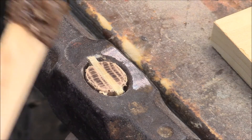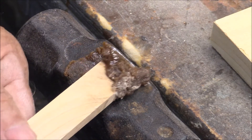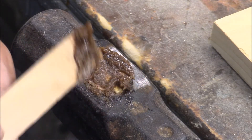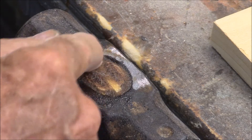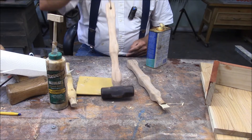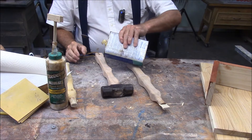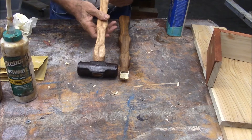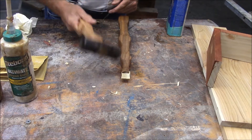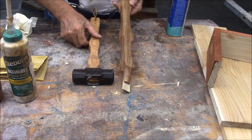What I'm doing here is applying a mixture of fine sawdust and epoxy to the top. It doesn't need it for strength or anything, but it just looks better. The epoxy didn't take very long to dry, so I put the little hanging strap on there, did a little sanding, and now we're going to put some linseed oil on it. There's the work we did with the wedge — so there's our finished hammer. Looks pretty good, I'm satisfied with it. I also put some finish on the prototype handle because it's just as good as the other one.